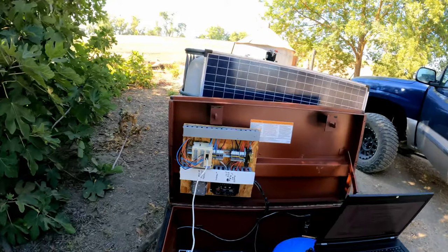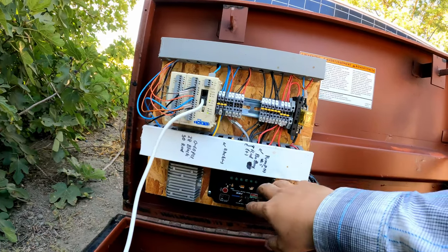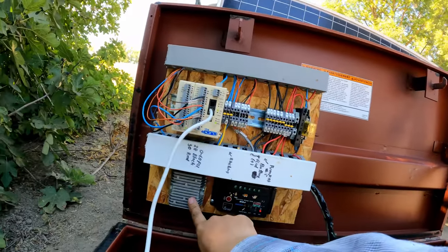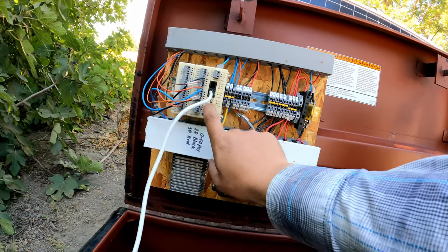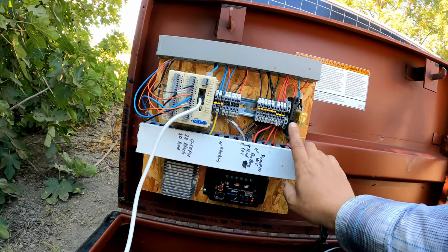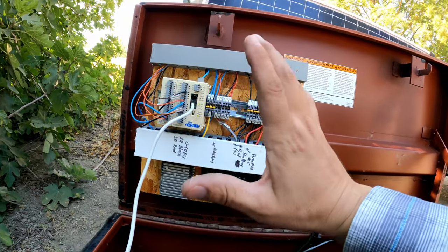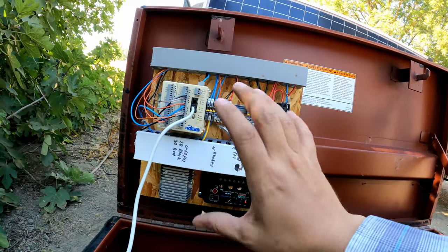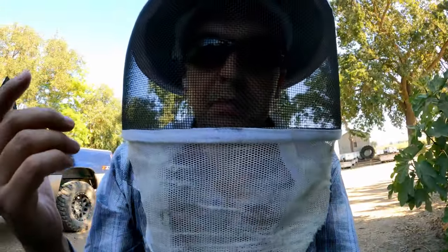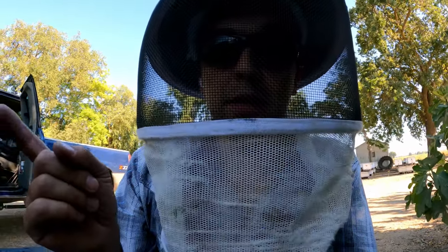If you guys want to know a little bit more about this: this is a Click PLC with custom software written in it. This is a solar controller - that's the solar panel. This is a 12-volt to 24-volt step-up for the PLC, and this is the relay to turn the pump on. This is the fuse for it, and this is just the junction wiring to make it all work together. I could miniaturize this, but at the end of the day this works. Yes, I could do it with an Arduino or embedded processors, but what really matters is that this works - and I knew it worked, so I just bought a bunch more of them.